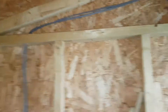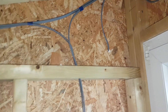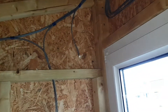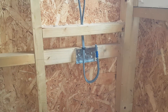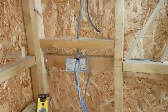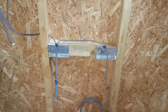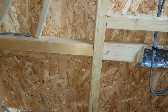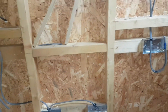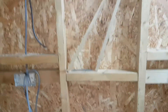These cables run out again at 120mm from the top — these two here are for the strip lighting that will go inside here. Then it runs down, and we've got external sensor lighting up there. Then we've got dual socket, dual socket, and dual sockets under the workbench. The workbench will be about 900mm off the floor, so these ones will be on top of the workbench.